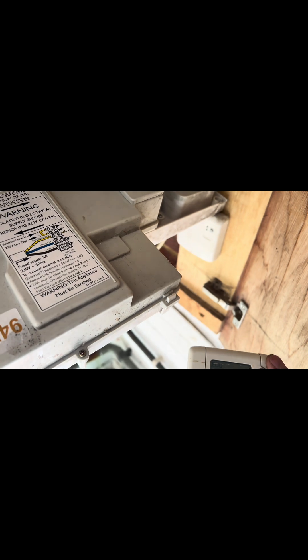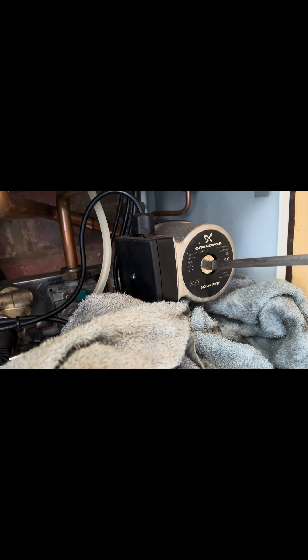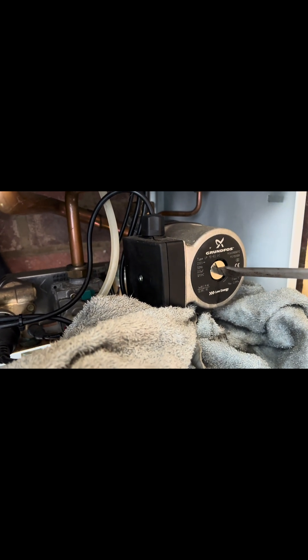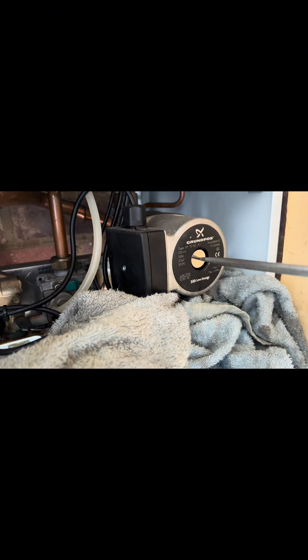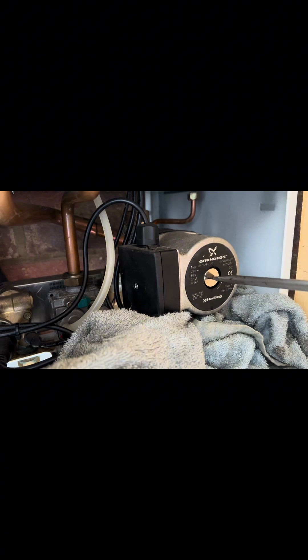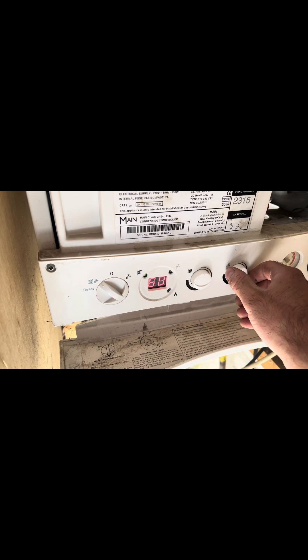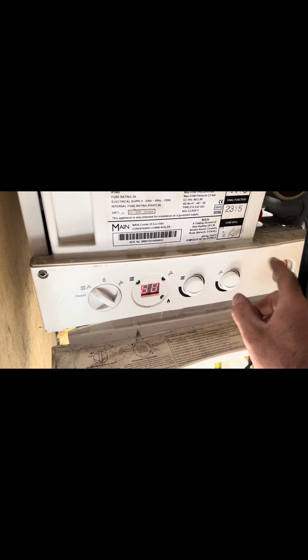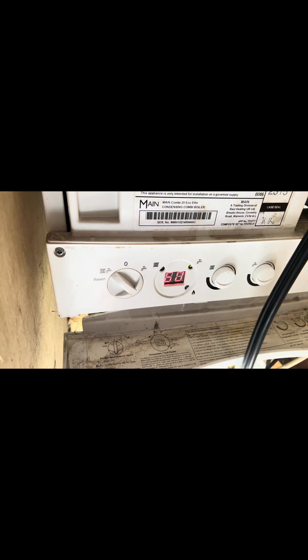Hopefully this should click on — which it has. I'll vent the pump now. You can hear the note change hopefully. Now putting it into service mode — put both dials back to zero, then click this one twice. This is how you do the temperature control.